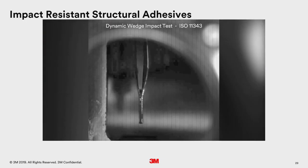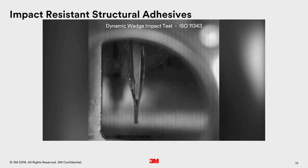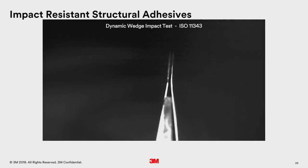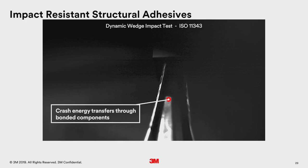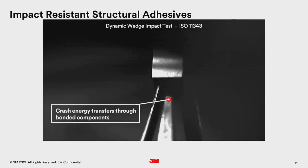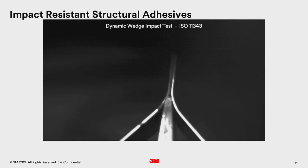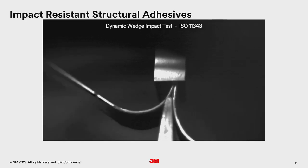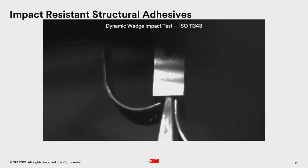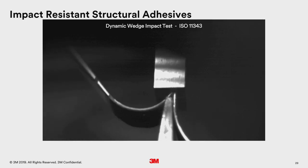Watch this dynamic wedge test. Here, a wedge is driven into a bonded joint to simulate the forces the adhesive experiences during a crash. This typical structural adhesive fails almost on impact. It no longer works with the surrounding substrate, and it can't help absorb and direct crash energy as it was designed to. Now, the 3M impact-resistant structural adhesive. Its toughness allows it to transfer the impact energy to the substrate over the entire joint area. Notice how the substrate curves away as the crash energy is absorbed. The force is managed according to the original vehicle design for passenger safety.